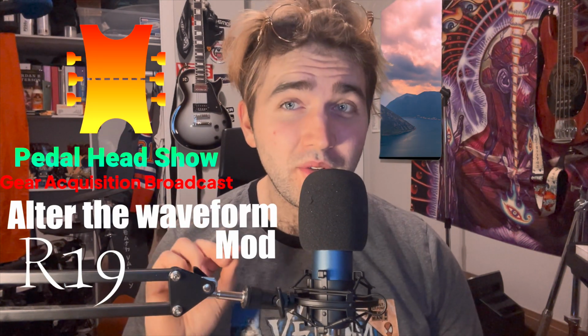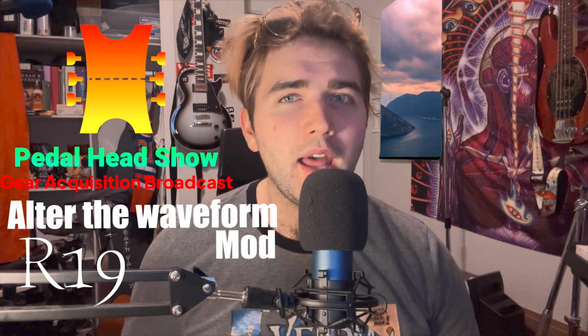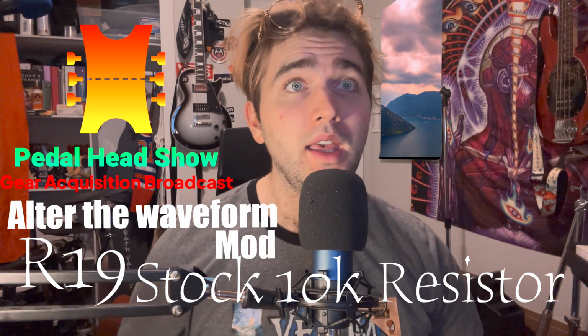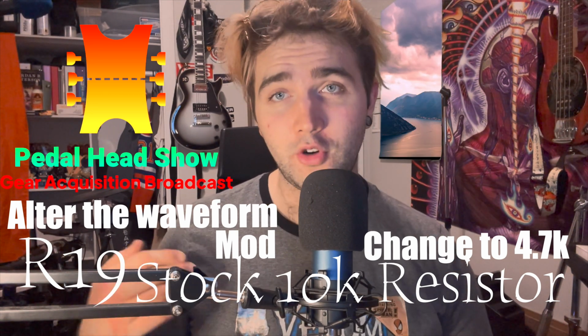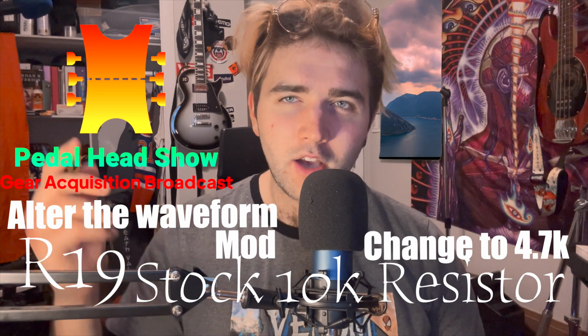The next mod we're going to be doing is going to involve changing the waveform of the sine and square wave of the TR2. Now, if we look at R19, stock at 10K, if we reduce that resistor to about 4.7K or 3.3K, you can drastically change the sound of the waveform. Tell me what you guys think in the comments below.